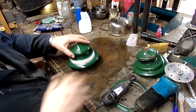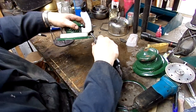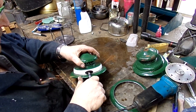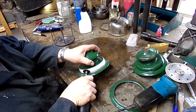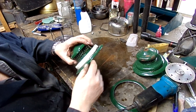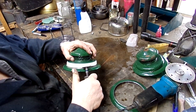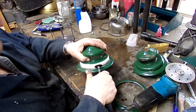Once again, you're not cutting straight down or straight in — you're cutting at an angle. I make one light pass around first; I'm not trying to go through the metal yet. That first pass just gives my wheel a track to follow so it doesn't wander all over the place. Once I've got my track, I come back and do a deeper cut, this time cutting right through the metal.